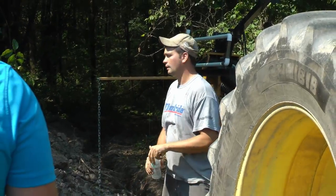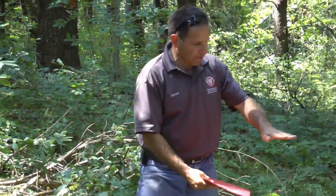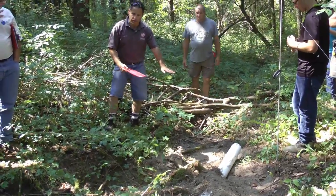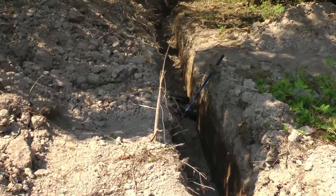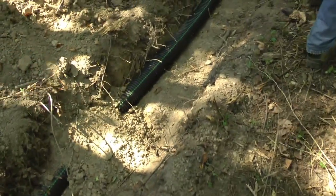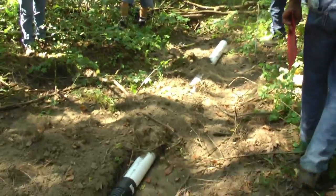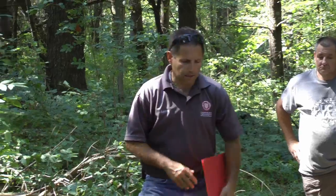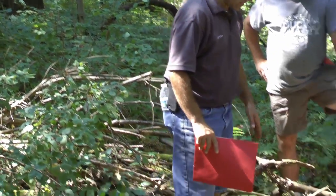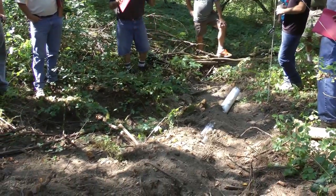Typically you'll lay your tile starting at the outlet, pulling to wherever you're going to lay it. At your outlet you really want about a foot of drop from your pipe to your normal water level, which I don't quite have here, but I have a plan to improve this. You really want two feet of cover over your pipe to protect it from machinery. I'm out in the woods, so I've got deer and rabbit running over this, so I'm not too concerned. I'm going to bring my backhoe down here, excavate this soil out, put it on top of the pipe to make my drop deeper and put more cover on the pipe so it's protected better.